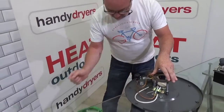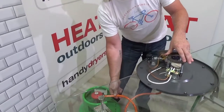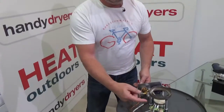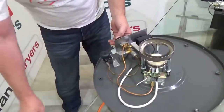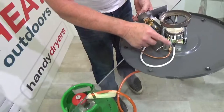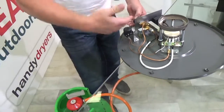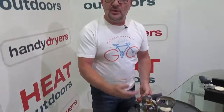While we're talking about the gas hose, it's important to note that the amount of gas flowing through this tiny pipe is relatively low, whereas the gas hose is a nice thick chunky hose. So when you first plug it in — if you put a new bottle on or you've put the heater together for the first time — this tube is going to be empty of gas and full of air. When you first push the button in to allow the pilot light to light, it's going to take quite a long time, because all the gas has to come up and push all the air out of this pilot hole. That can take a couple of minutes, so don't be surprised if it doesn't light straight away. Just be patient and you'll find the pilot light will light.